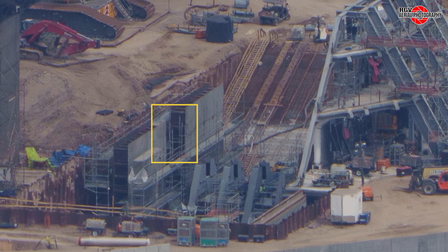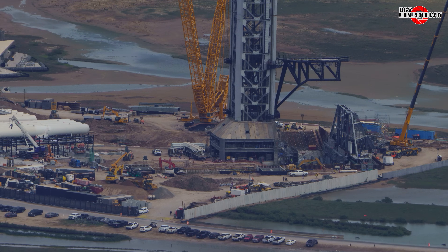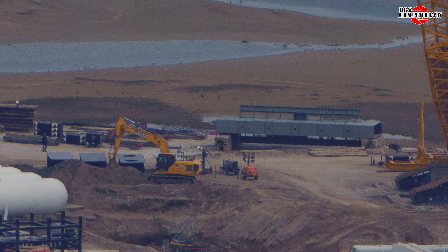Several panels were missing in the middle and were lifted into place on April 7th and 8th. In the centre of the trench, the five support frames located under the flame bucket have been lifted into place. Some of the remaining centre panels can be seen near the yellow excavator. There are two panels with holes — one visible has two holes for the water supply pipes for the flame bucket, and another with a single hole behind the excavator will allow the pipe for the centre ridge to pass through.